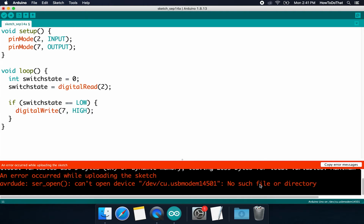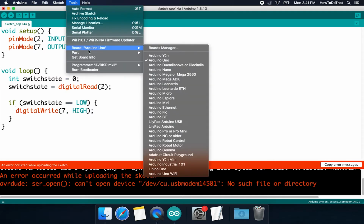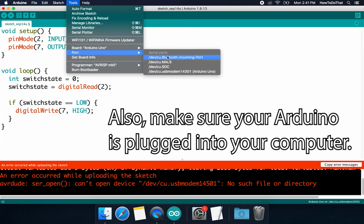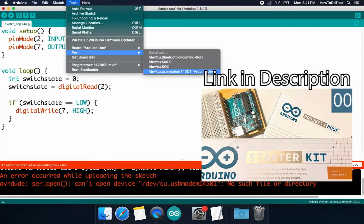What that typically means is, if you go up here to the Tools menu, it either means the board is not selected, which Arduino Uno is the correct board, or it means the port is not selected, and that's actually the issue here. So I'm going to select the correct port. If you need more advice on how to do that, if yours doesn't say in plain English here that Arduino Uno is connected, please see the initial setup video also on this channel that takes you through some troubleshooting for that.